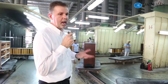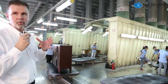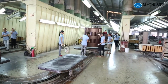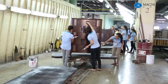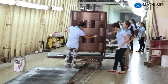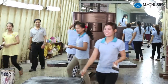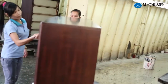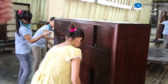Wood is a natural product — we can't control the look or the cut of the grain on it. Each tree is unique, and each growth ring is unique. So even with all the finishing steps we go through, we still have a process where colors vary from one drawer to the other because of the veneer. You can see the handwork involved where they're taking what we call the dry brush and blending in the colors so that you get a consistent color and the proper effect of the finish. This is a very labor-intensive process that requires people with skill and ability to see what they need to do in order to make it blend together.